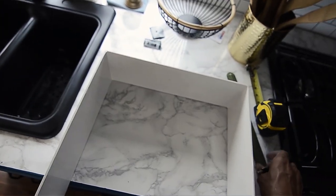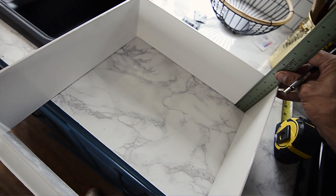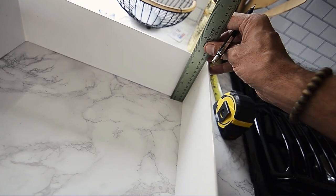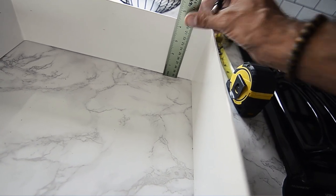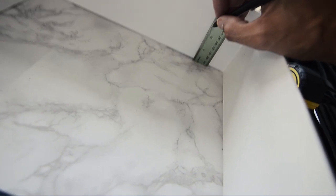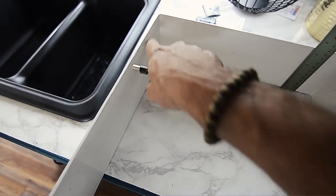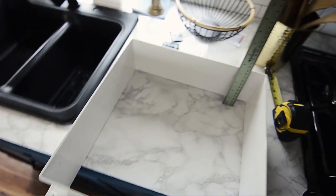So now, like I said, this needs to be recessed into the actual fan, so I have to measure from the ground up what I need to cut. So, for example, like I said, 1.5 inches plus an inch will give me 2.5 inches. So I measure out 2.5 inches, and there's my cut mark. And I gotta do that all the way around the entire perimeter of what I just talked about. And then all of this top piece right here is all gonna come out. Two sides will be on angles, and two sides should be straight, but they're all gonna go cut all the way around. And then I'm gonna recess it.